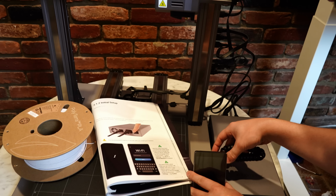There's kind of an issue with this laser head in that there's no enclosure for this machine. So you're just firing a laser downwards at this gigantic surface that has a bunch of reflective stuff on it potentially. I mean, I get that they're black anodized aluminum, so they should do a pretty good job of absorbing the laser radiation. But you've got these fasteners. I assume they're shiny, just like the rest of the fasteners on this machine. So you've got some really shiny fasteners that are definitely going to be scattering laser light, potentially into your eyeballs and making you blind. I mean, this just seems like a really bad idea. It can potentially blind you if you're in the same room with it, so that seems like a bit of an oversight. It's got a little camera on here, and I guess with Wi-Fi control you can set up the job and run it from another room if you want to be extra safe.